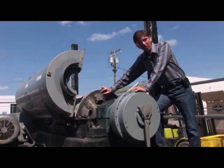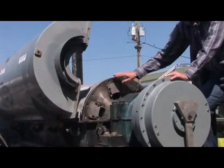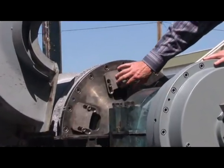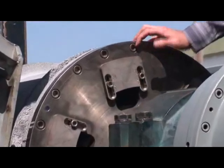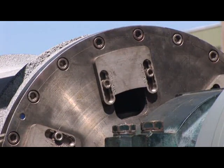These are the pool plates for the overflow ports, which are adjustable. You just back these bolts out a little bit, then you can slide the plate up and down for different settings. This controls the depth of the pond inside the centrifuge, which affects your cut point and your solids dryness.